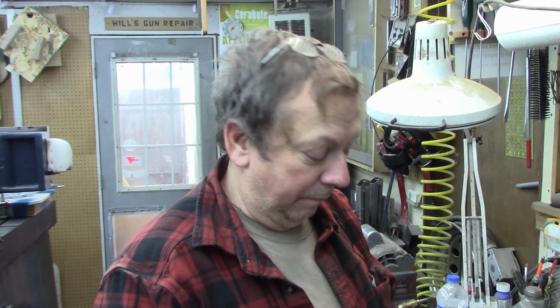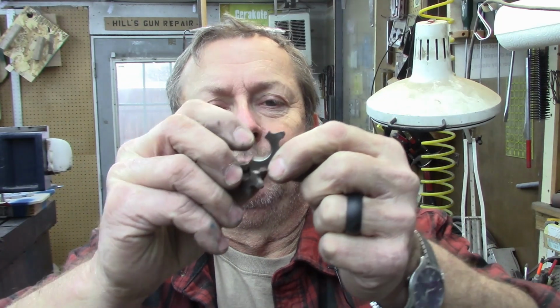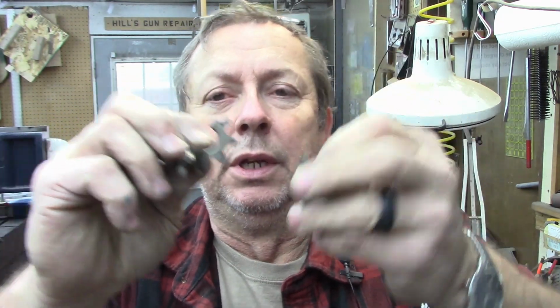My planer's down. I broke my little planer, a little DeWalt 733. The small little planer. Had it for years. I replaced one set of bushings in it, I believe for the drive rollers, a while back. And here I was working on a little bit of stuff outside the other day, and I work this stuff pretty hard. These woodworking tools, I kind of tend to abuse them slightly. And I was going along, and it did a big loud clunk, and everything came to a halt. And it busted 2 gears. This is a chain drive for the drive rollers. Busted 2 of the gears out. There's half of the other one.